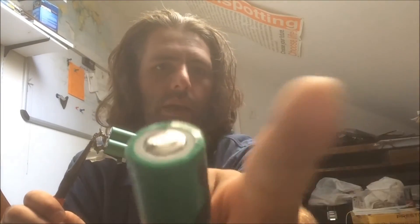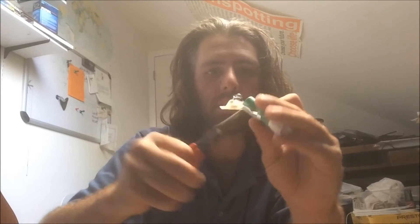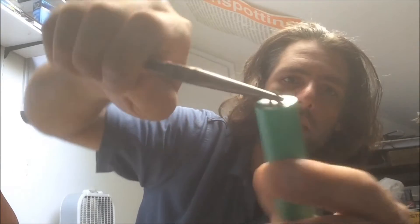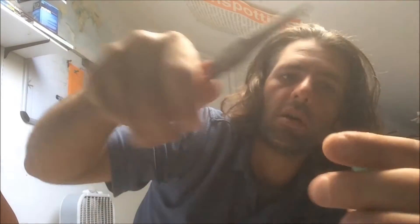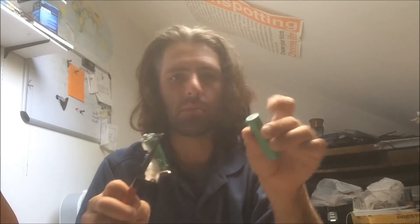Just pop the welds right off. This top cap here — don't worry about buckling it or bending it, it's a metal plate that's laying on top of the actual cell. Do your best not to scratch or rupture the shrink wrap around the case, because the metal case is conductive and you can short out the battery with that. Just roll the tabs and twist the tabs off of the end of the cell. Most of them only have two little spot welds — they're easy to pop.